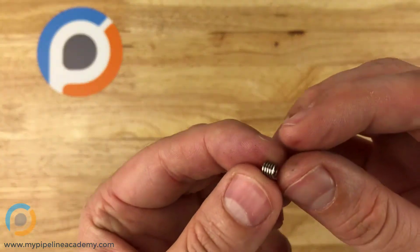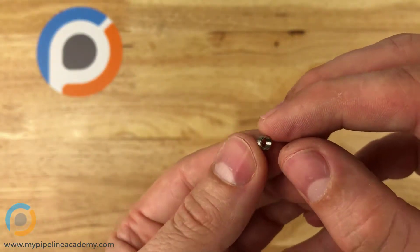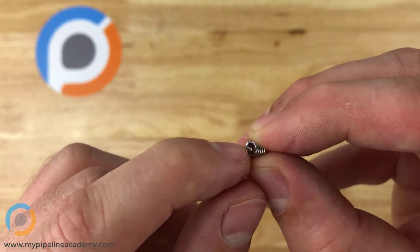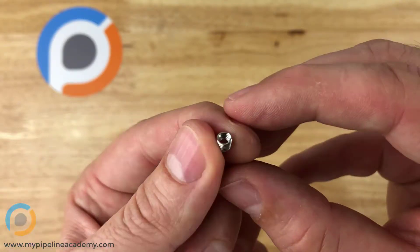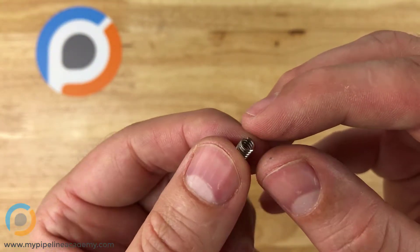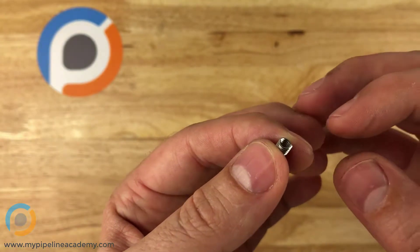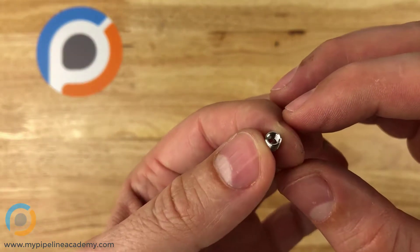The last style is this one right here. This is called a helicoil, or a helical insert, and this is the kind that I prefer. It works really well, though they are a little more challenging to install. They require a special tool that engages this little prong down here at the end. Once the helicoil is installed, that prong gets broken off — it breaks off pretty easily with the right tool. Then you're left with just these nice threads that sit inside the hole in your part. Typically helicoils are used with aluminum. Aluminum is a fairly soft material, so you can thread it directly and many people do, but there are applications where you might be worried about the aluminum threads stripping or getting damaged because of high loads. In those cases, it's a great idea to use a helicoil like this.